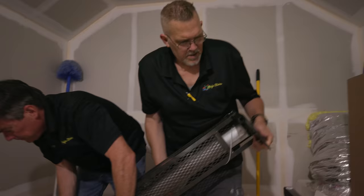We'll do that on all four corners. This is our safety strip — just a visual aid so that when the basket is down, objects don't fall over. Secure it with a few nails, centered from side to side. Put the nails in the black spots so they're not visible. This is another safety feature — it is a chain, but I would not rely on this to hold a person in place. We do have little holes to hook it into. It's another visual cue that says 'do not go past this point because you don't want to fall down into the attic.'